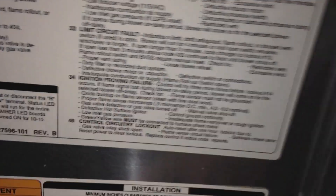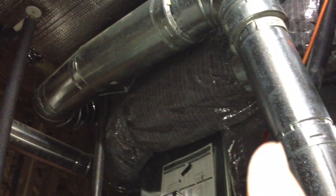I even took that off, took the filter out, and tried to run it, and it still kept tripping saying it was getting too hot. It says the problem could be a loose blower wheel — the one inside here. If that's not working right, it's not going to blow enough air, which means the blades get too hot and that switch trips again. Excessive wind: if it's a really windy day and the exhaust pipe has wind blowing across the top, it could push gases back down so they can't escape, causing it to get too hot and trip. That wasn't my problem either.